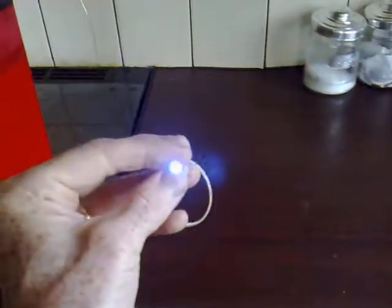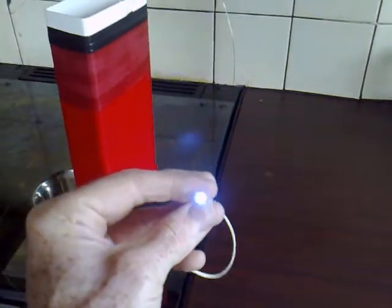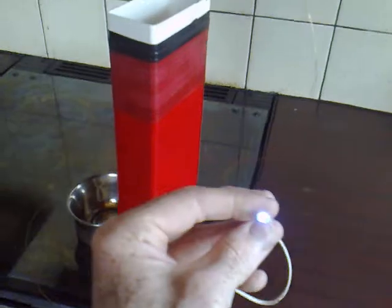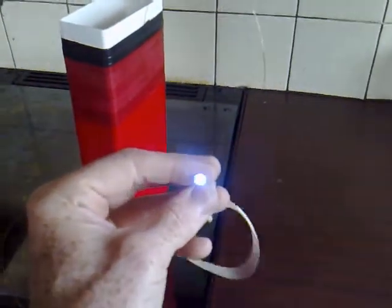The Avramenko plug with LED is vital for finding when the towers are actually locked into each other. They seem to lock to each other — they can be completely dead, then you jiggle the wires and move the pan, and suddenly the LED lights up. That's when you know they're locked in, and you really can't do this tuning without one of these.